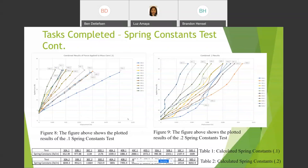From the spring constant results, samples with higher durometer and a smaller Sorbothane gap proved to be the stiffest. In the face-load tests, larger displacement was observed because cores had room to travel, resulting in lower spring rates. Most spring rates were linear with an average R-squared of 0.99, with one outlier at 0.96 for the 40B.1 test. For the perpendicular tests, cores had no room to travel due to the constrained environment — which is also why we cannot use Sorbothane's published data. Spring constants ranged from 4,912 to 14,500 pounds per inch, with non-linear loading behavior, so it was recommended to identify the specific force range in application.